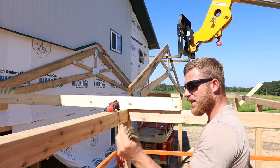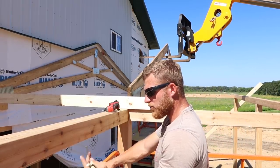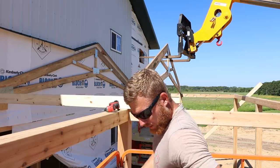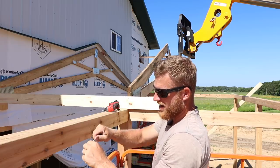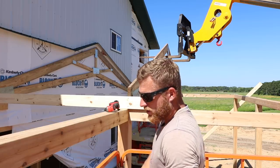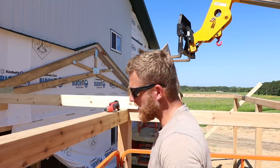So see, that's the problem. A lot of people use a screw to frame with, but that's not really what you should do unless it's a structural screw, because screws break. Nails like our 20 pennies have good shear strength. They bend a lot before they break, so they can hold up to forces. But you already knew that, right? Yep. But I didn't know if you guys knew that, so I took that as an opportunity to share.